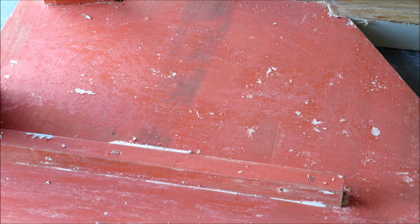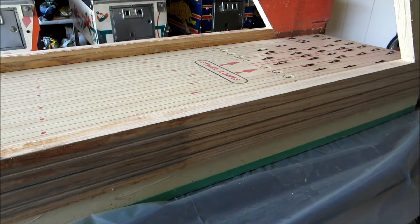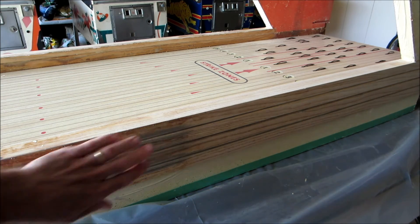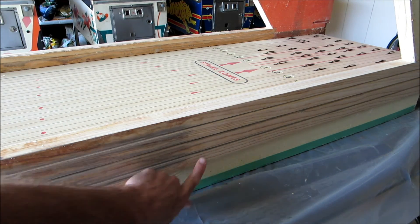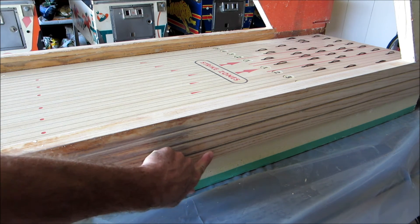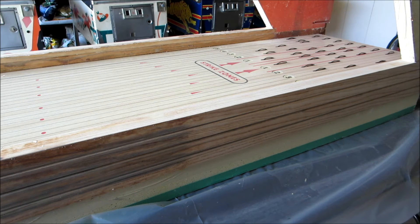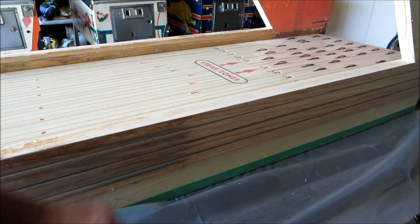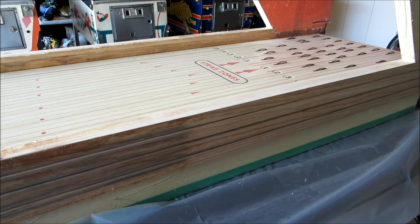I'd hoped to not have to repaint this orange — I thought I could hopefully strip off the white and have a decent enough finish. But I'm going to hit this with light sandpaper, maybe 600 grit, to see if I can knock off the remaining white. I bought a quart of paint at the home improvement center to see if we can make it look nice. Here's a pretty good view of before and after sanding. You can see some pretty dark areas from that black lacquer that was in the grooves, and then on the side where I sanded it at least got rid of the black, but there's some white in the grain. I'm using 120 grit sandpaper in an orbital palm sander — it's doing a great job, but I don't think it's cutting enough to get into the grain. I might try something a little coarser and then hit it again with the 120 to get rid of that white.